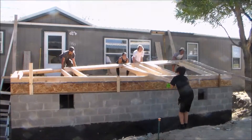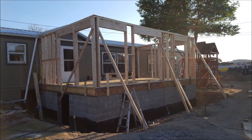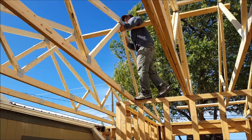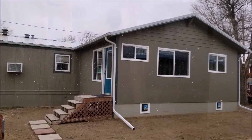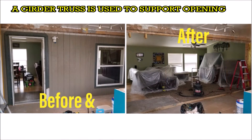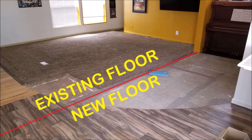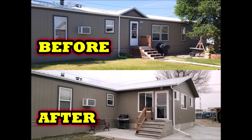After sealing the floor, we started the framing process for the exterior and interior walls. This is the first wall we put up, which was 24 feet, then here it is after putting up the side walls. I'm installing the roof trusses, which also tie into the existing roof. Here it is after getting the exterior of the house finished. At this point, we started tearing down the old exterior wall that separated the new addition — here it is before and after. This is where the front door used to be located, and here's where the two floors meet up after tearing down the old exterior wall. Here it is after finishing the interior, and here's a before and after picture with the new addition. I will have a lot of other videos coming out soon covering a lot of this building process.